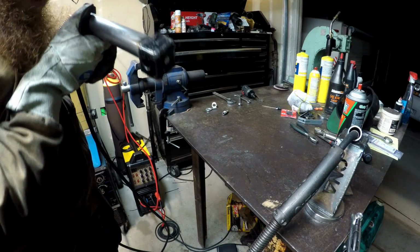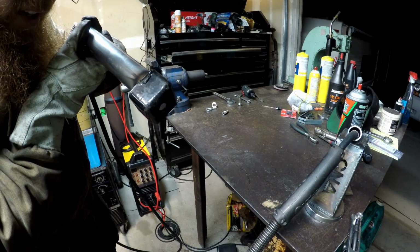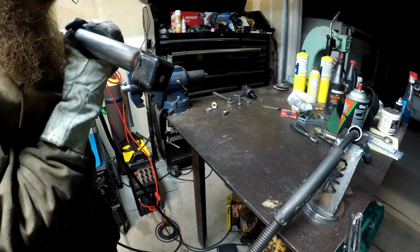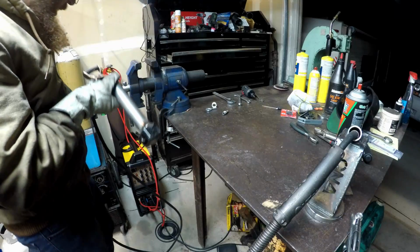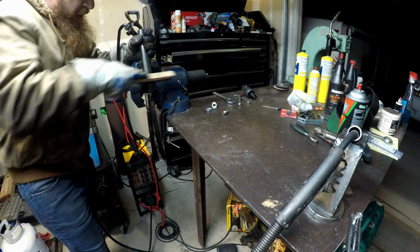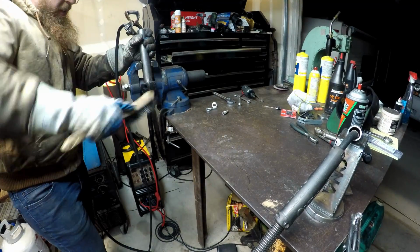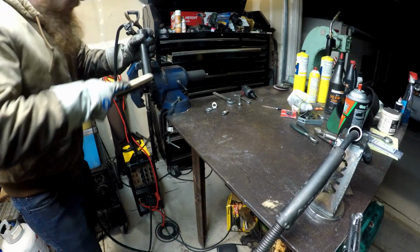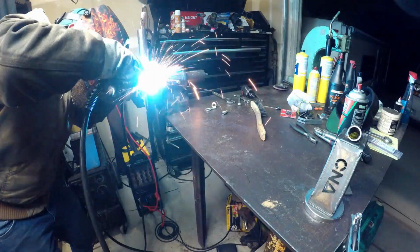Well, that powder coat reeks. And the bead almost looks a little cold, even though I kind of swore that when it was hosing in, it was really digging in hot. I don't hear any tacks cracking, which is characteristically what would be happening to these tacks over here. And also note, I didn't preheat this at all.